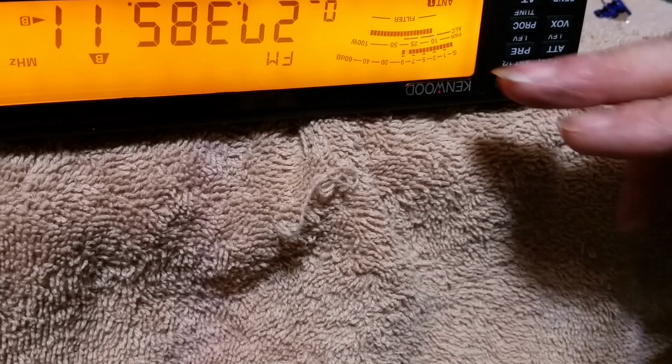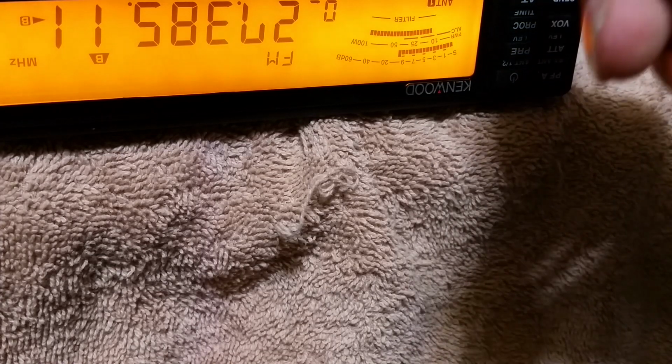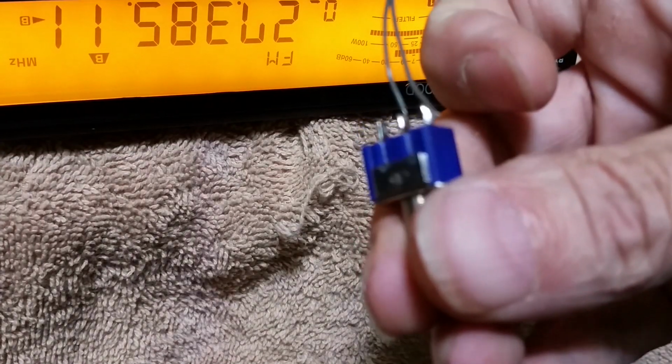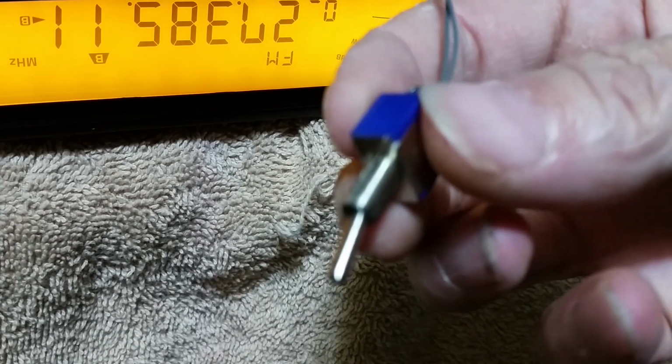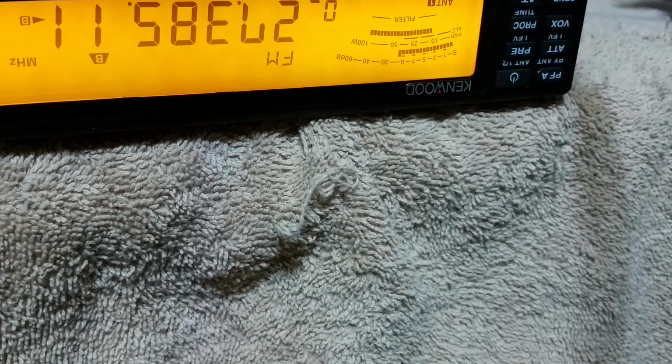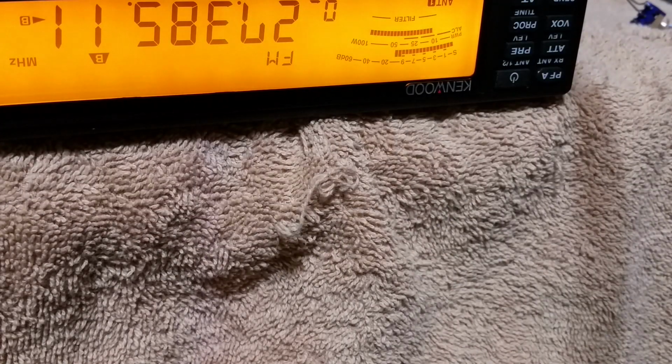Cool. It does not affect the meter. If it does, it's very, very little bit. So we don't need to worry about any specific resistance on the meter. So I can either take the switch and mount her in the back, or I can just permanently modify the ALC for wide open. I, myself, am going to go for putting the switch in the back.